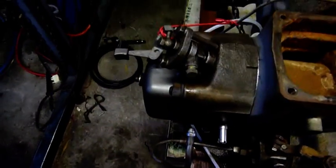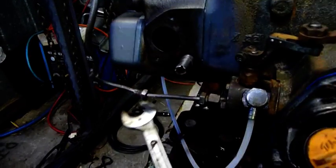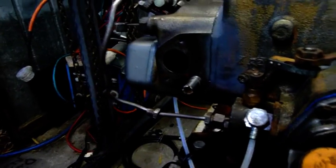I still haven't done the oil thingy but I decided to just see if the injection pump will prime up and work properly — seems to be doing so. Can't disconnect the injector and try it though, and the other ones I have an external nut, not an internal one. I suppose you'd have a female thread on the injection rail instead of a male thread, so I can't really test it I think.